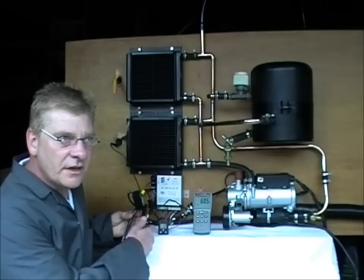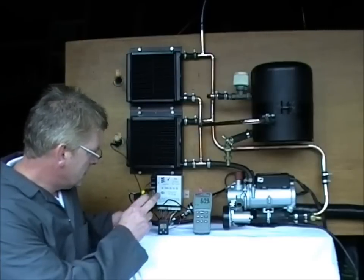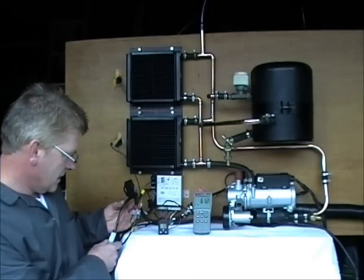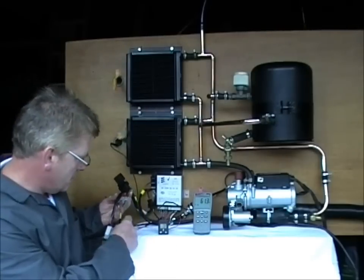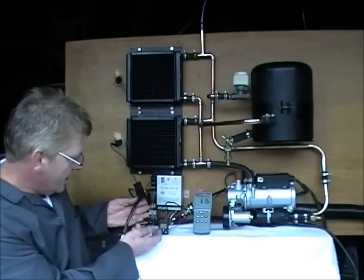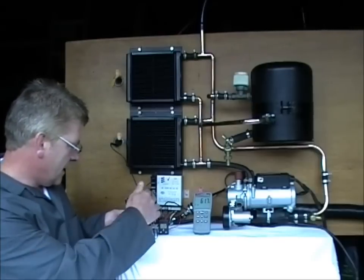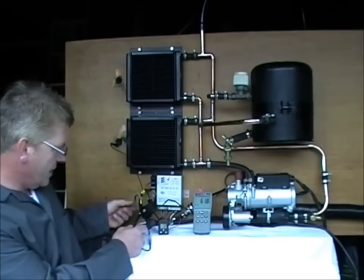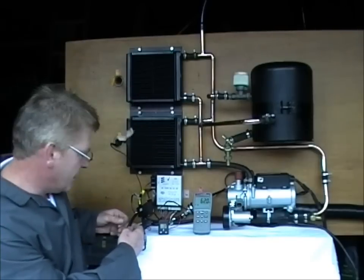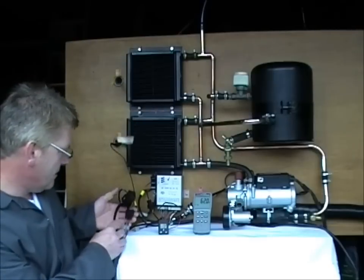On this heater we've actually wired in a little relay with a switch in of these fans to come on automatically. Main wiring loom we've obviously tidied up from the original Ford one. We include these cables here so that we can actually supply this part if you needed automatic switching. Normally it would come without this little relay pack.